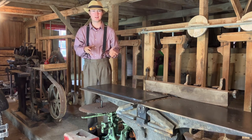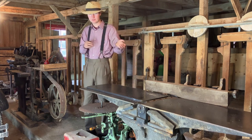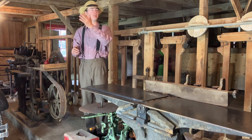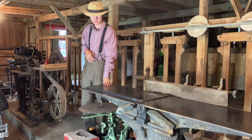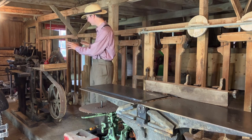If the planer does end up getting set up in here, you need a good length in front and behind for your infeed and outfeed, and putting it in line with the line shafts running this way doesn't really make sense. Generally on the joiner you're running shorter stuff, so it's not as important. But enough with this — on to the new machines.